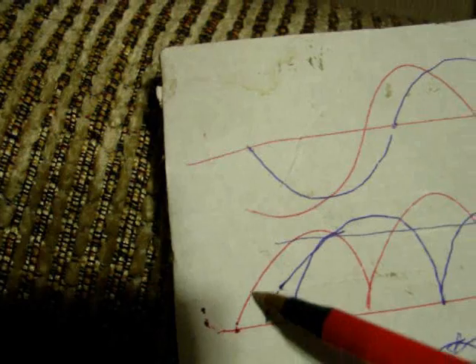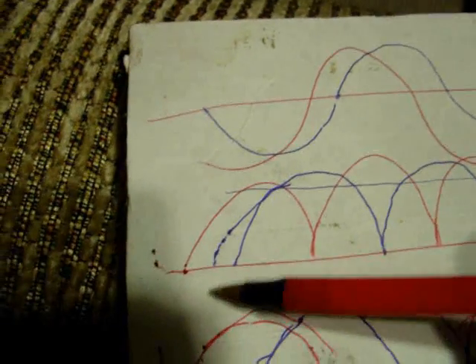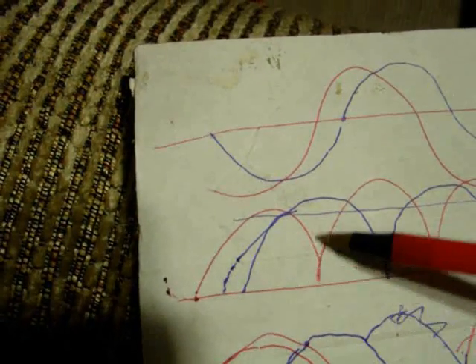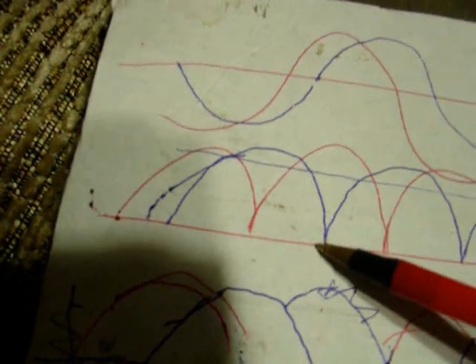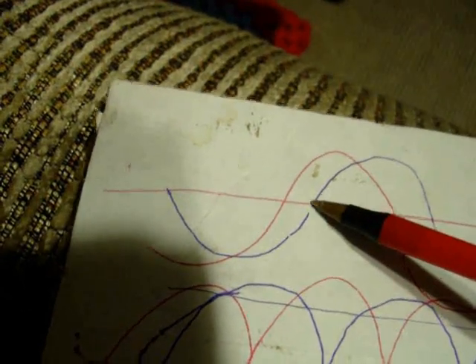This means rectification of coil one being red. This is positive, this is negative. This is all positive up here; this is the zero line; this would be your negative swing. After going through the diodes, your red wave would look like this — kind of like the golden arches, but red. At this point you've got zero voltage, same thing at this point, and this point on this wave.